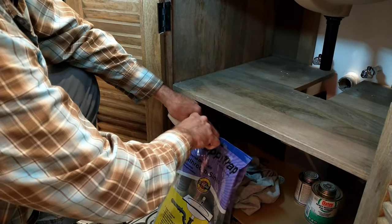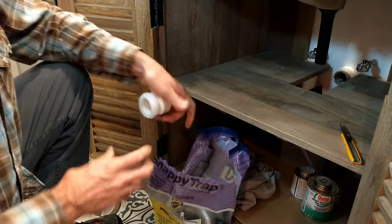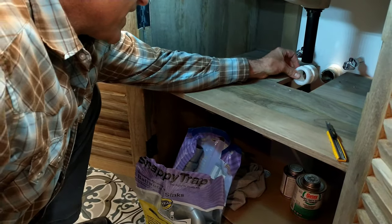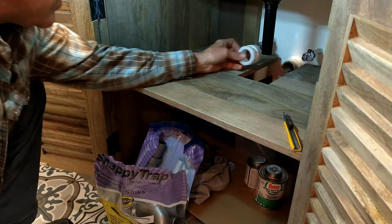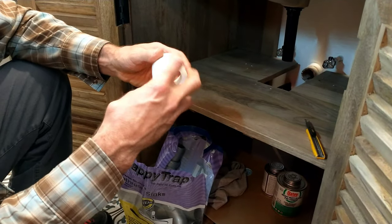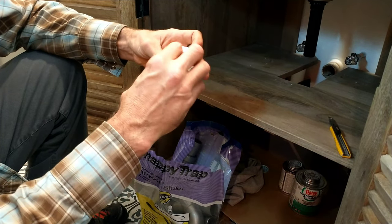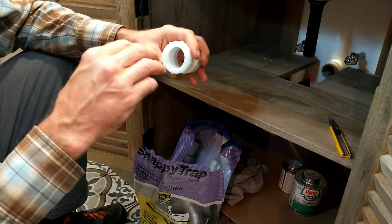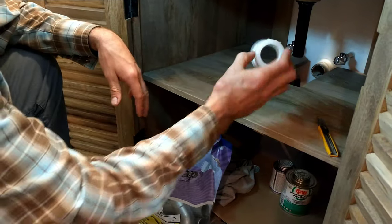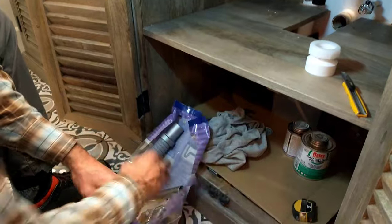We're going to go ahead and open up the bag and see what we need for this installation. I did buy an inch and a half trap adapter that I'm going to install on the inch and a half pipe coming out of the wall. The other one was defective — I had to cut it out, but this is what it looks like. It just has a male thread here and this connector goes on and it literally bites down to the pipe. It can telescope in and out depending on how much pipe you need. I'm just going to pull this out and get an idea of what parts I'll need.